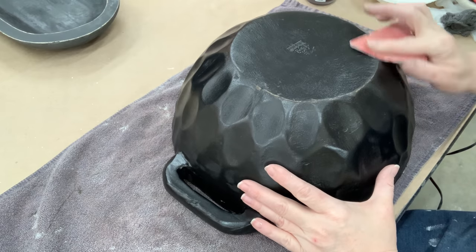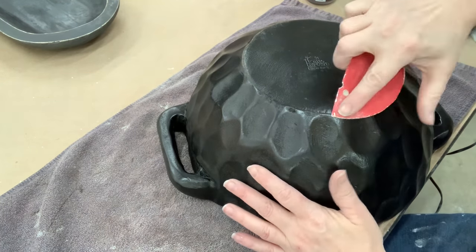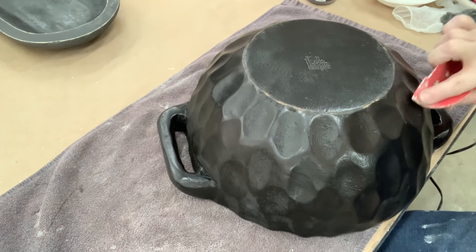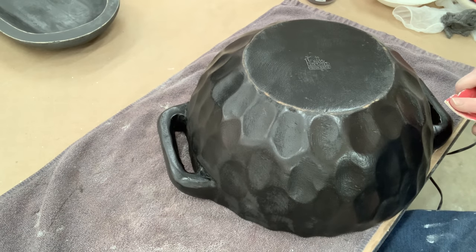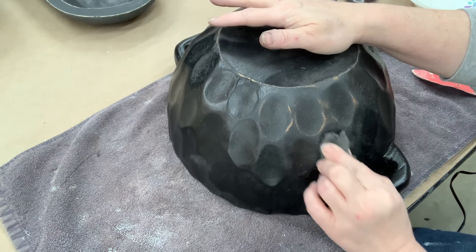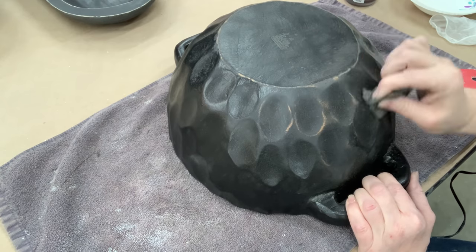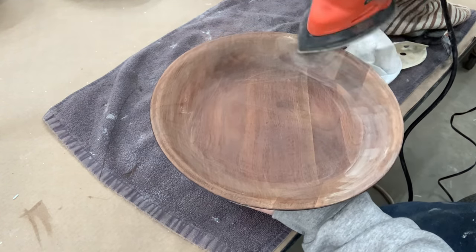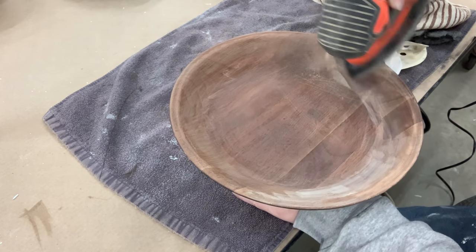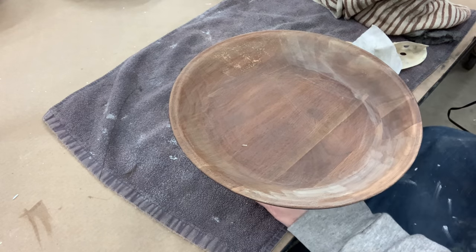For this Katie Brown bowl I was going to be leaving it black, so I was figuring out how to tackle this one — it has a lot of areas that need sanding. I go in on the bottom with 220 sandpaper, hitting the edges, then quickly switch over to steel wool to just sand the piece with elbow grease. The sandpaper on the sides was scratching it too much since it's not a flat surface. After getting the bottom painted I loved how it turned out, but I didn't like that manufacturer stain they put on these pieces. So I'm going in and trying to remove as much of it as I can to get down to that raw wood underneath.